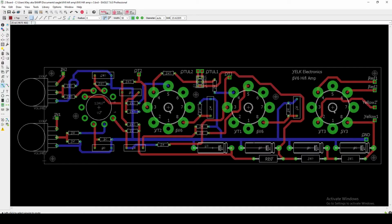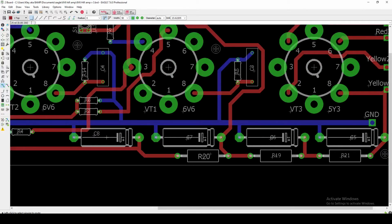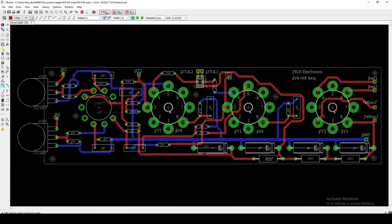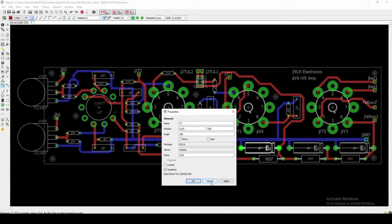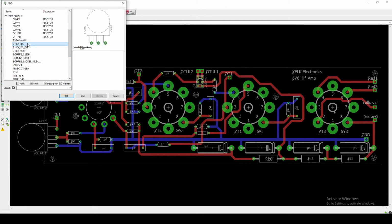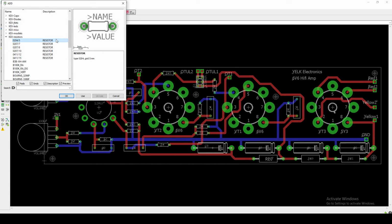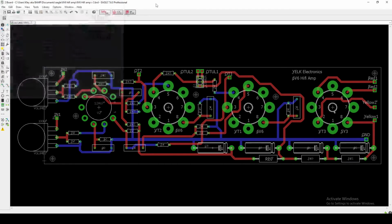I think maybe the only other thing to mention is I had a heck of a time with this B plus step-down circuit here, getting the correct sizing for the resistors and the capacitors. I'm still not even 100% sure that this is the correct sizing, but it's what I've got, and it's what I'm going to stick with. That's just some of the prototyping stuff where, ultimately, the best practice is to physically get some of those parts and measure them out. If you pull up this component in here, you can actually see these resistors and how big they are. Right here, you've got this 5 millimeter, so this would be a pretty small resistor, and you definitely need something a little bit bigger there to make sure that we're on the right track. That's a part of this where I had to find some larger sized parts to fit, because my library didn't quite accommodate it easily.